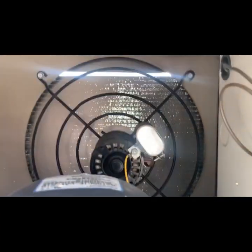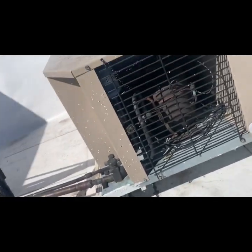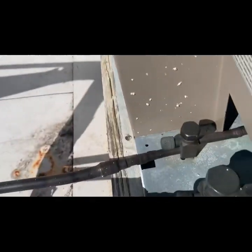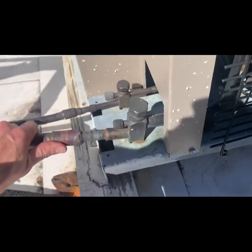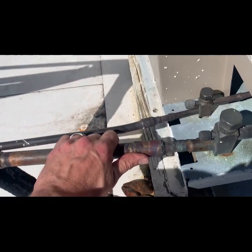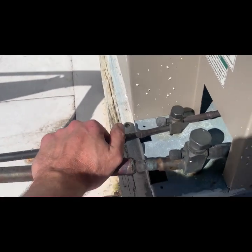Microchannel coils — not awesome. Yeah, it's freezing up. It's freezing up because it doesn't have a defrost, and where it's at, they're in and out of it all day getting milk and it's sucking in that hot back of house. I'm not even putting gauges on this. This is not short. I can tell you that by the temperature it's coming back at.